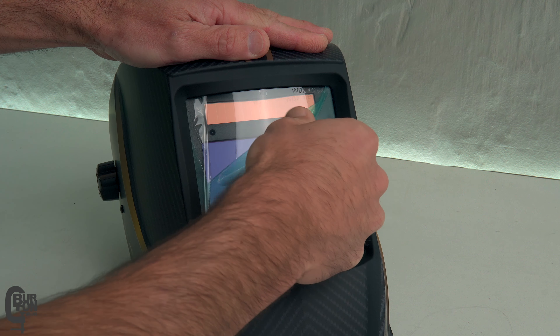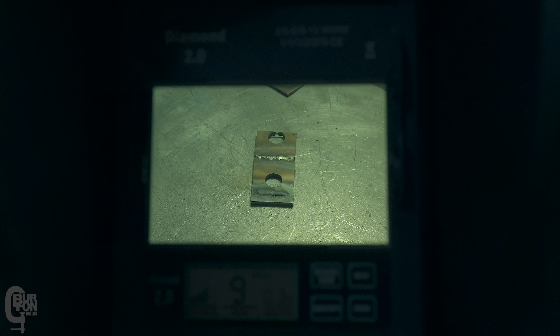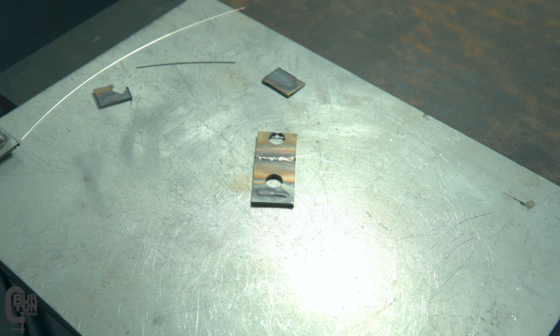The new Titan Diamond helmet has a very clear lens in both the dark and the light state. When it's in the light state, it's almost like you are looking through nothing at all — like looking through a clear piece of glass. There is still a lens there and it is actually shade level 2, but it is really, really easy to look through. When I'm loading lots of small parts into a fixture and welding them, I don't need to raise the hood each time. This speeds up the process and makes it a lot more efficient because you can see so easily in the light state.